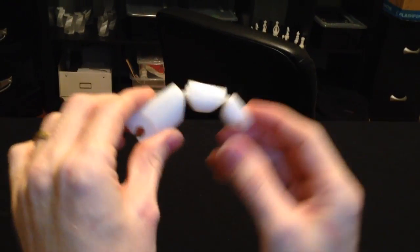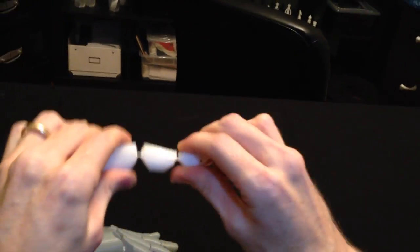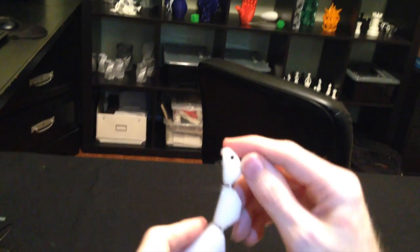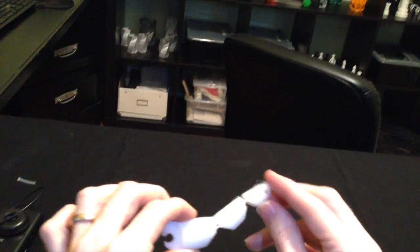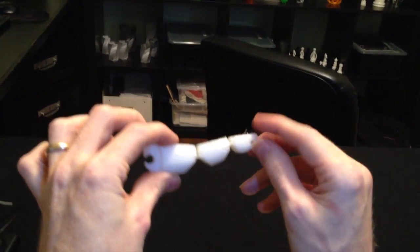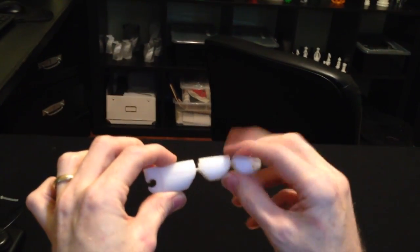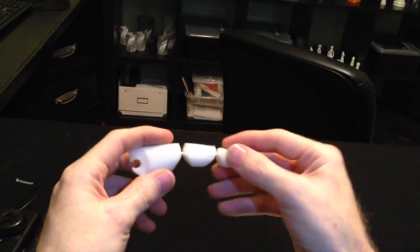Wow, that's pretty interesting Skip. It seems very strong as the nylon materials go. I'm giving that a really good pull and that's not going to break easily, but it's got nice flexibility. I don't know if it's got enough stiffness for the return movement without using the flexible cables like we've been using. Maybe if we added a little bit of thickness in those flexible joints you could achieve that. The other material I'm testing actually has more flexibility, so we'll follow up on that.